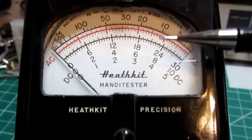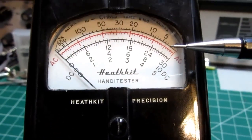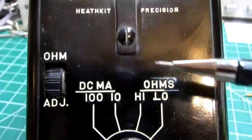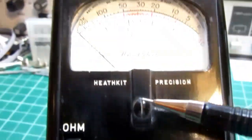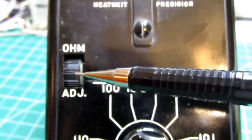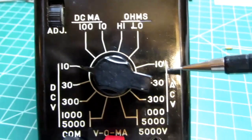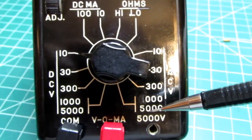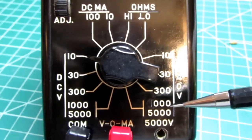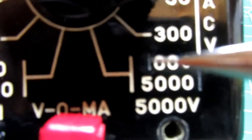That offset is because it's always going to read a bit lower on AC due to the voltage drop of the rectifier — not something you usually see with solid-state multimeters, because they use a precision rectifier op-amp circuit which negates the voltage drop. These analog ones don't have that advantage unless you add an FET front end. We have the screw for adjusting the meter to zero when there's no power, and the ohms-adjust trim potentiometer thumbwheel, with four ranges for AC and DC volts.